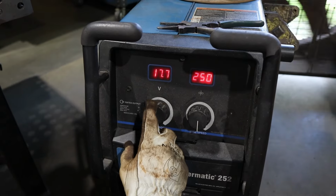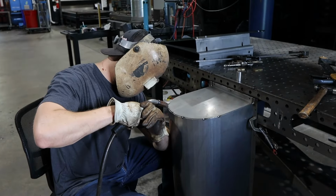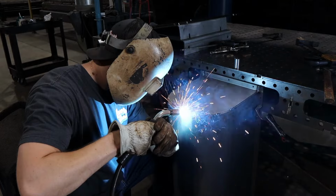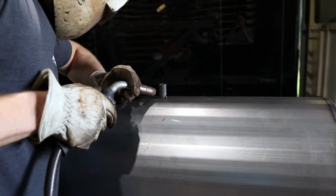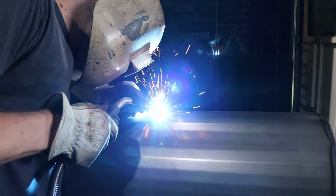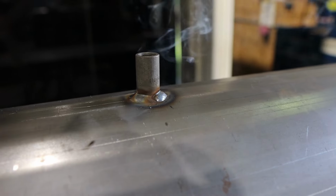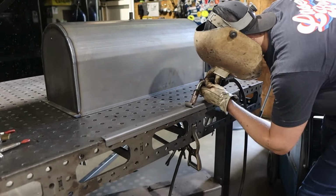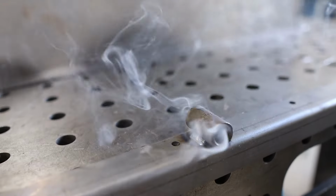Once everything is tacked up, you can proceed to weld out. These welds need to be watertight, so do a good job. Now you're going to weld the quarter inch MPT fitting on the bottom of the tumbler. This will line up with a small hole in the bottom of the tumbler body. You're also going to weld the second MPT fitting onto the long UHMW hold down angle. The location for where specifically to weld this can be found on the weld out PDF documents.